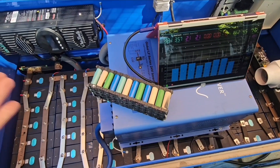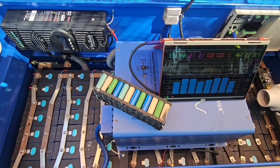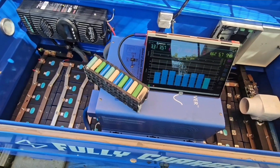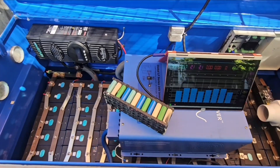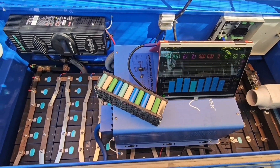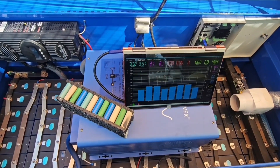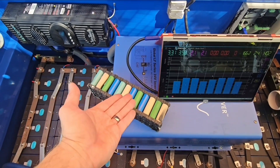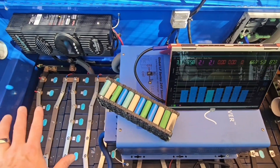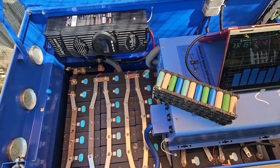I can't build a whole 18650 Tesla Powerwall here with original Tesla 18650 cells because they don't sell them — I'd have to use used cells. My opinion on used cells is this: they're not going to be able to power your house for a long period of time. To invest this much money and time into building battery packs, you don't want to waste your time. Because of the light weight and how fast it charges — for portable applications — the 18650 or Li-ion cell is a great thing. But for something stationary, you're going to want to use LiFePO4, definitely, just because of the life expectancy and the amount of energy density you get out of it.